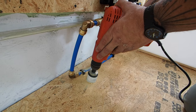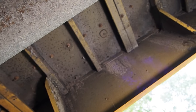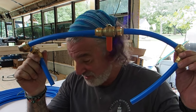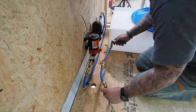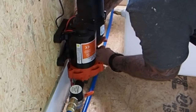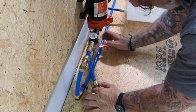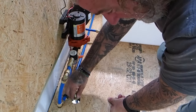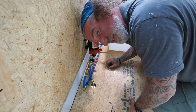Next up is a drain. Sometimes you want to drain your water tank and the pump doesn't work, so you can't pick up the tank and drain it. You've got to run a hose through one of these ball valve fittings down through the bottom of the bus, which means I've got to drill a hole through the floor. This weird-looking contraption is the actual drain — it's got a bunch of bends and twists, but there's absolutely no pressure in it. Basically the idea is it goes out the hole and into the bottom drain plug. This lets you empty the tank directly below the hose — and yeah, I know that hole's a little big; it was the only hole saw I had.